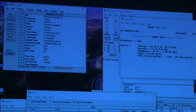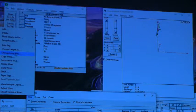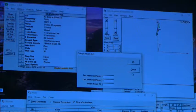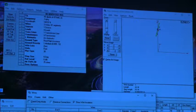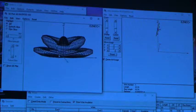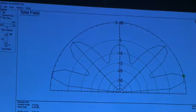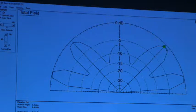Pretty sombrero. Gene, go up to about 150 feet. Now what happens is, a dipole will start to show that classical broadside pattern at what's called free space. Well, free space is several wavelengths up. It'll start to show it, look at that. It'll start to show it at about a half a wavelength. Still got the 8 dB gain here, yeah, but you've got a 7 dB gain chunk up there too.